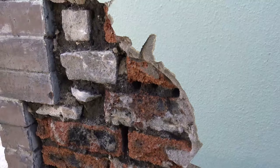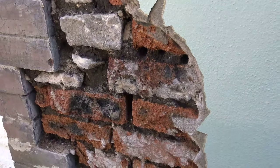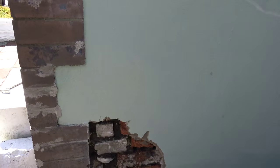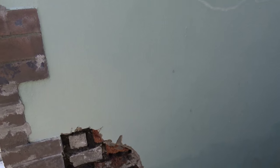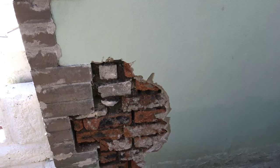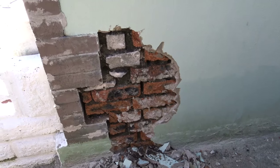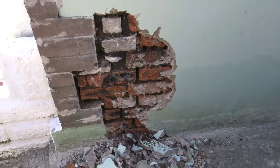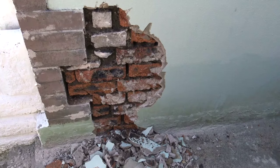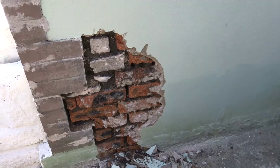This is the worst case I think I've ever seen of cement render trapping moisture into a wall. It's mind boggling. So what we're going to do is take a wee bit more off this and try and find out how far this problem goes. Because I think we've now explained why the house is damp and cold. It's not a massive job to dry it out - we've just got to get this stuff off and then make good inside. There's a little bit of work to design this and work out what we're going to do.